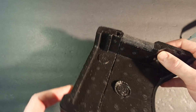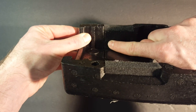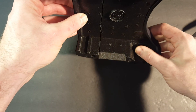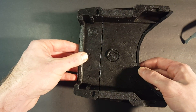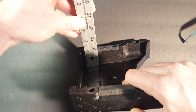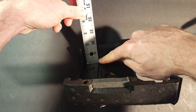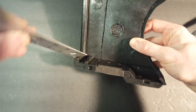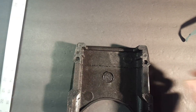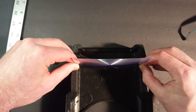The next thing we're going to do is carve the groove out of our goggles. You can see the groove that I carved here along that leading edge, all the way along the long side, and the same thing on the other half of the goggles as well. To do this I took my straight edge, put it up against the leading edge of where the original frame slides, and take my knife and go up along that straight edge. Repeat that process for the other side, and then I took my lens and slid it carefully into those two grooves.